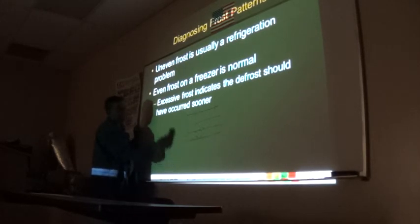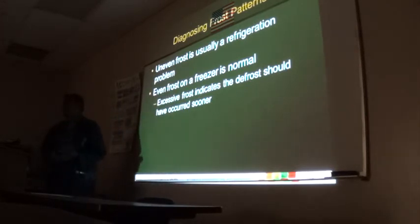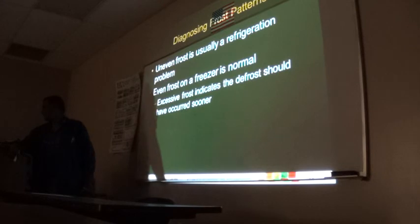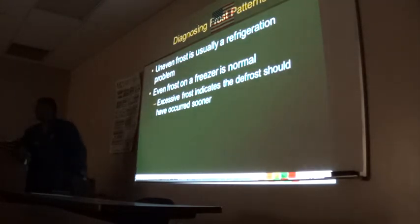No, you don't have to reset it. Can't you push the solenoid on the back of that time clock and it switches, right? No, there's a switch on the thing that you can just turn it off. No, you can move the clock. I know you can move the clock until it contacts the switch, but isn't there on the back of that little coil a switch you can push to pop it? No, that switch is to take it out of the defrost, that's all it is.